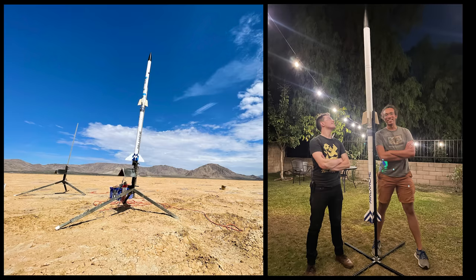With that all covered, we got the vehicle out to the launch pad and sent it. The flight looked gorgeous from the ground with successful ignition on both stages, but the separation mechanism wasn't quite strong enough. As a result, we accidentally hot staged, so that little camera inside the interstage didn't make it. This was a super fun flight though — I've never done a two-stage flight before, and there's some interesting ignition logic that had to happen on AVA to determine if it's safe to light the upper stage. I don't think I'd fly a two-stage vehicle again with only a week of preparation, but I did learn a lot. Andrew is a fantastic rocket engineer and his YouTube channel is linked in the description.